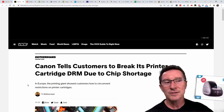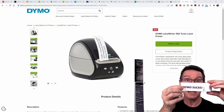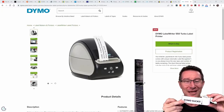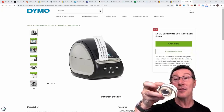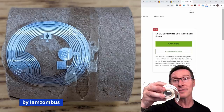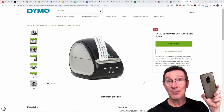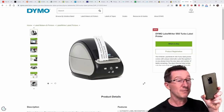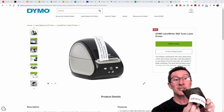I've got one of these things, so let's verify what they're actually doing. Check out the tiny little roll you get in the brand new printer box — unbelievable. This is the normal size roll you'd get — they're just taking the piss. You can verify these things have an RFID tag in them. I'll put a photo up — it's embedded right at the end of the roll on the cardboard tube. You just use your phone with an NFC/RFID reader — the NXP RFID reader app, which is free. And ta-da! NXP IC detected. We've got all the info.